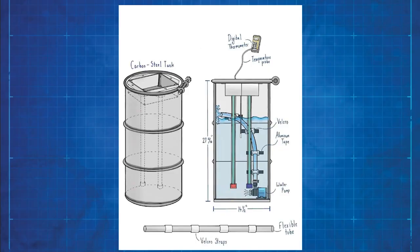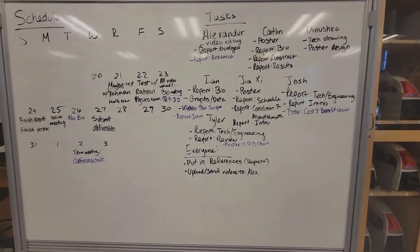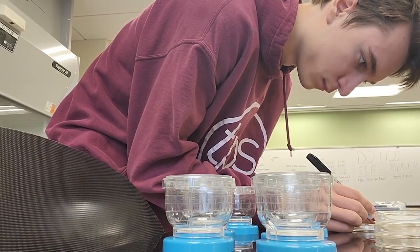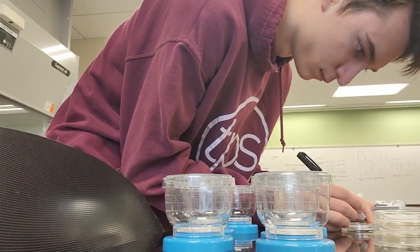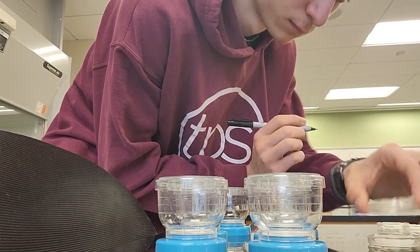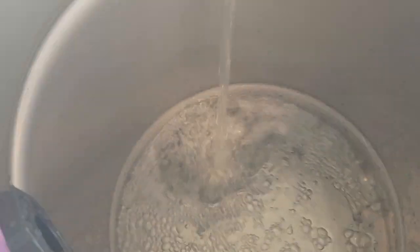But now that we made it, let's test it. We use microbiology methods to test the effectiveness of our modified tank system with the addition of the pump in eliminating bacteria in drinking water. Our success criteria for testing were the following. 1. Reach a bacteria count of 0 CFU per 100 milliliters, and 2. If the addition of the pump increased the rate of bacteria elimination.